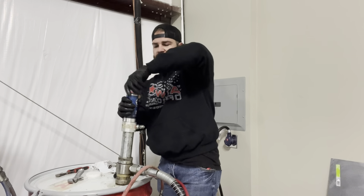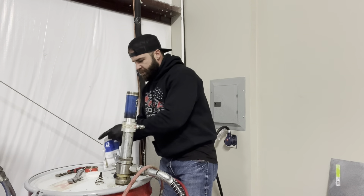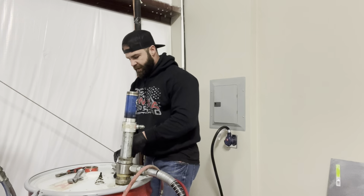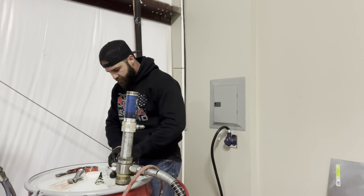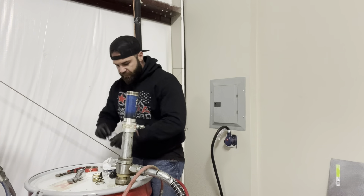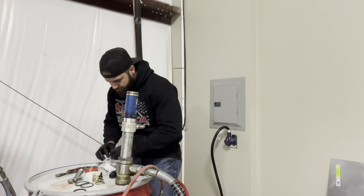Now I'm going to pop this out and go to my Graco kit — part number 247958, the T1 upper rebuild kit. It has a brand new spring in it, plus instructions, your lower spring gasket, top gasket, gasket for the diaphragm itself, gasket for the lower, and there's a diaphragm included as well.